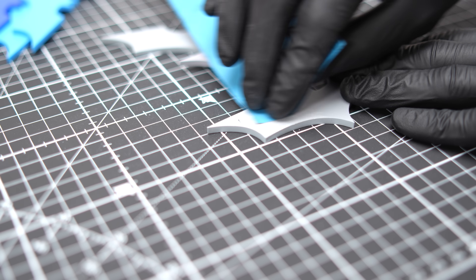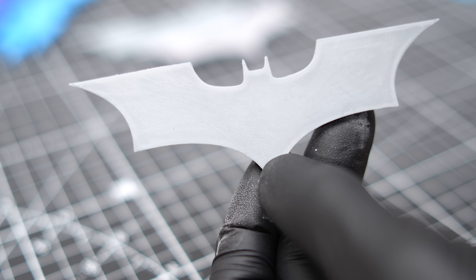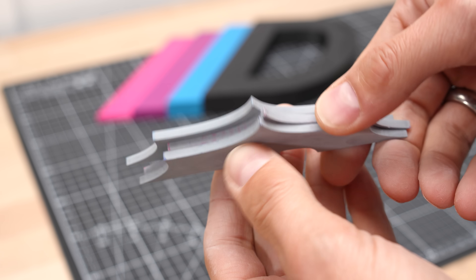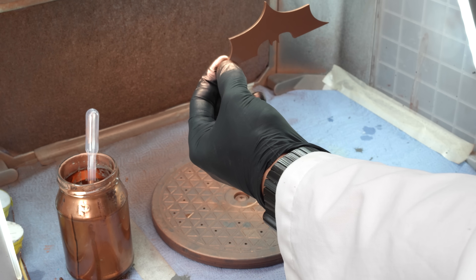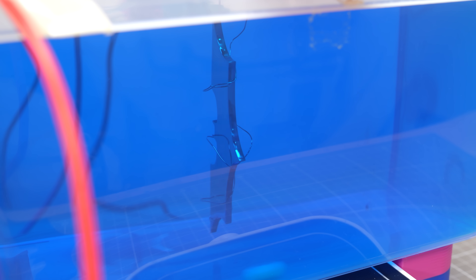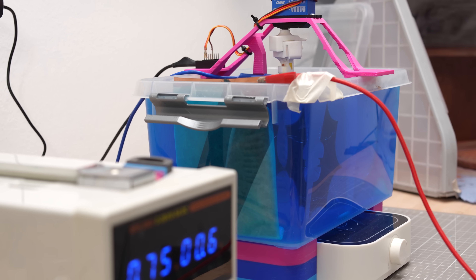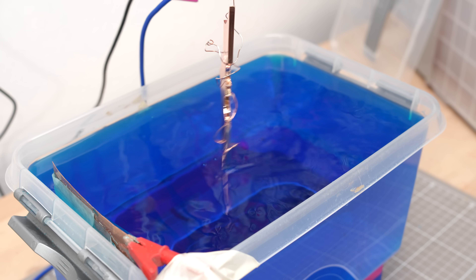I use sandpaper to make everything even smoother and more level — 1000 grit is fine. By now it's well filled, and once it's thoroughly dry, I recommend airbrushing with copper or graphite conductive lacquer. It takes a bit of practice and I don't really enjoy doing it — it's always a bit of a thrill. If you mess up here you can start over from scratch. But once there's a layer of copper on it, the only thing that can ruin it is fingerprints. So always degrease everything thoroughly and ideally don't touch it while it's plating.